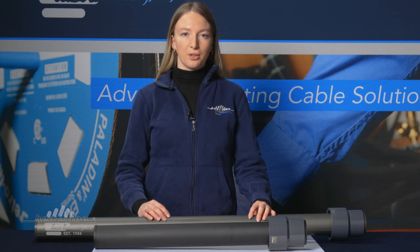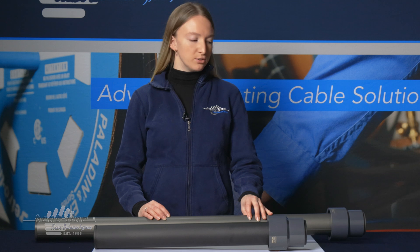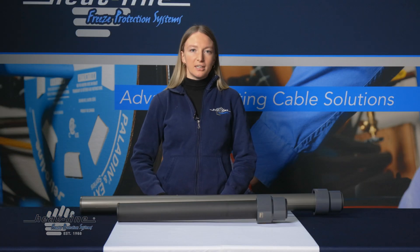The greater the length of the Arctic Vent HT inserted below the roofline, the greater the performance. Therefore, HeatLine recommends using the 42-inch model. HeatLine recommends only using the 24-inch model when there is not enough room in your attic for a straight-run installation.